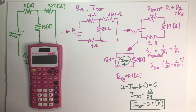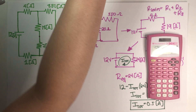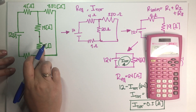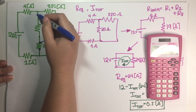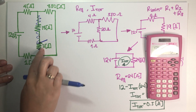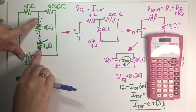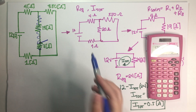Alright, so this is the end of part one. Let me read part two: the 7-ohm resistor burns out so that current can no longer flow through it. What is the new equivalent resistance of the circuit? For part B, this resistor burns out. So instead of having a resistor, the entire branch is cancelled out — because if the branch opens up by burning out, then no electricity can flow through it, and that basically cancels out the entire branch.